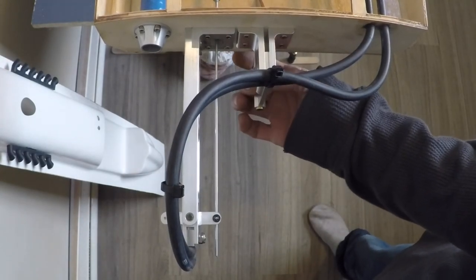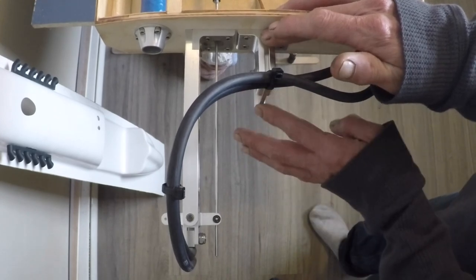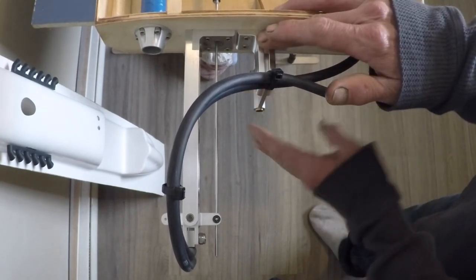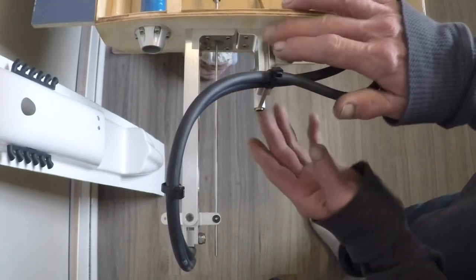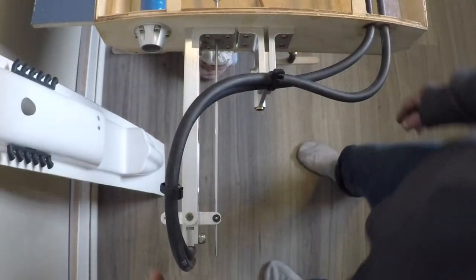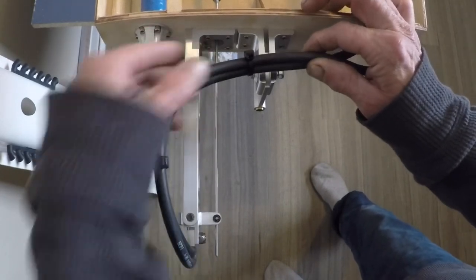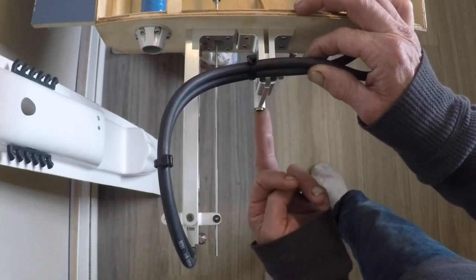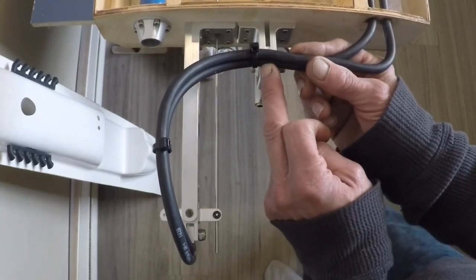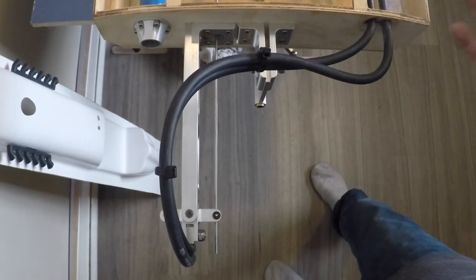When it comes to the strut on this boat, this is a Speedmaster hydro strut — it's a flat bottom one. Right now this strut blade is too short and should be approximately a quarter inch lower for our stuffing tube, so before I use this boat I'm going to get a longer strut blade for perfect alignment with my stuffing tube. I took the time to mount my water lines and bring them up through the hull. I've noticed in prior builds that guys like to clamp them so the water lines don't get in the way of the propeller, and I'm going to figure out a neat little mount to hold them snug.